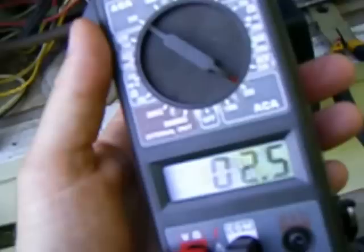The model number is MICRO P711. I would have no hesitation installing this aftermarket board — it might even be better than the original. The original manual said 2.7 amps under load, and my clamp-on ammeter is showing 2.6 to 2.7 amps — right on spec. The heater is now getting extremely hot, which means my fridge is getting cold. That's how you fix your Dometic 2652 refrigerator. Enjoy your day — bye!